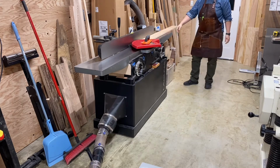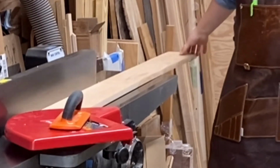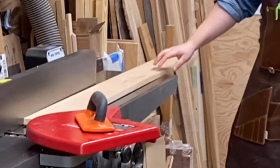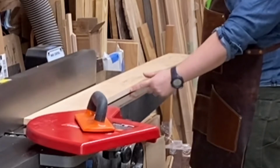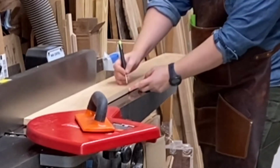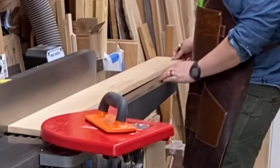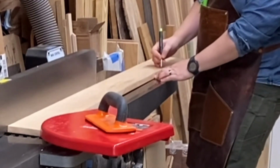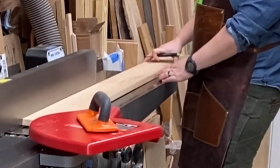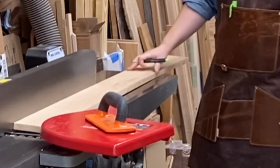So this one's got a high spot right there. If you had a shorter bed, you would of course keep missing out on some of that. That just kind of continues. So right here used to be the highest spot, and it would touch here. So touch, high. But then as we continue going, like here's now touching, and it keeps getting higher. Obviously I've got the blade that's preventing it from continuing to really get this in the same plane.